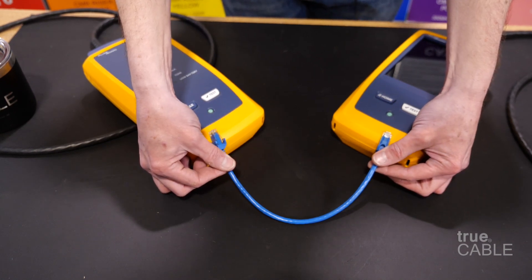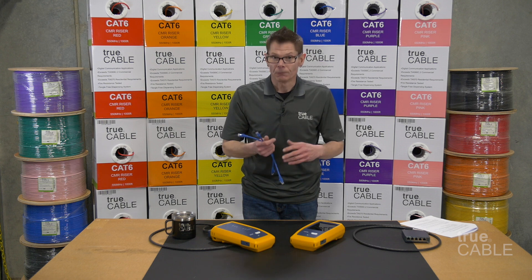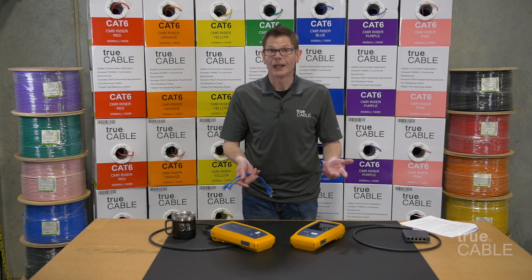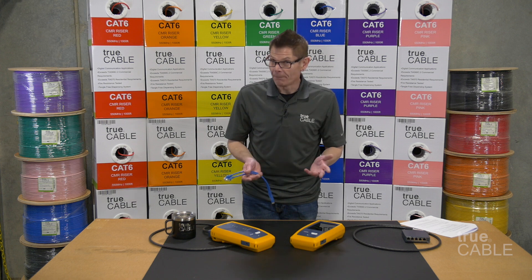That's really all that it is. Don't make more of it than needs to be made of it. Just make sure that if you're doing a regular normal network and putting in a regular normal cable, both ends are using the same color code and you're sticking to it. I prefer to use B, but other people prefer to use A — one is not better than the other.